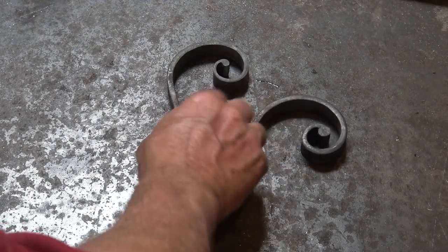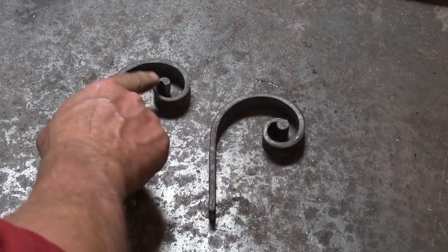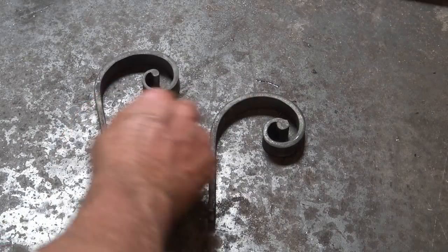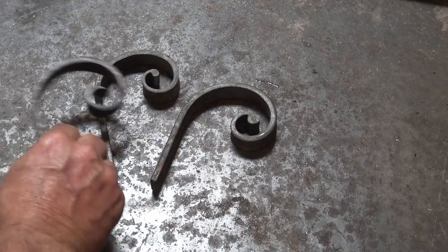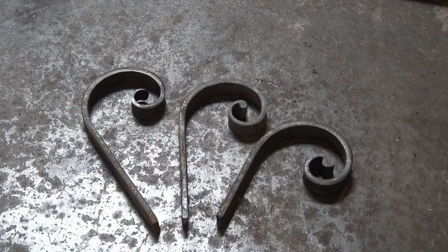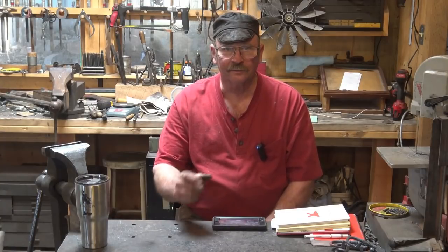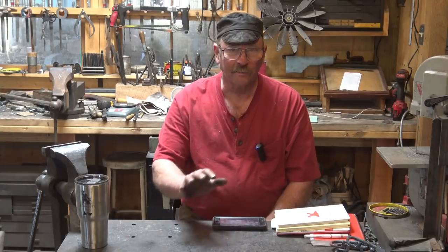Here we have two different interpretations of the same concept — just a mass that is rounded up on the end of the bar. This is just kind of an upset square corner folded over, nothing too difficult. And this is a simple forge weld — it makes a much nicer, much larger snub end. We can compare these to a simple ribbon scroll, which is what we did for our grill project, and you can see this adds just a little bit more interest on the end. We will discuss the other two scrolls — hay penny and bolt end — as separate videos, because they both have some unique elements and are a bit more complicated than what we did today.